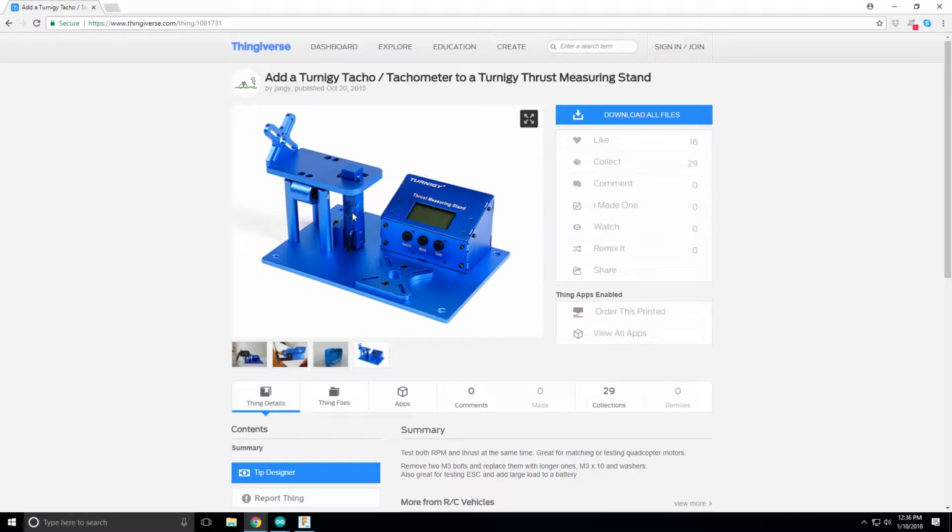And what it has is very deep cuts inside to make this side and this side of the beam very thin. That way, when you apply very little force, you'll have flex in this aluminum beam. It's made out of aluminum. And then on this side and on the back side, they have strain gauges which measure the bend of the material as a change in resistance. By doing testing to find out what resistance equals what deflection, they could figure out the force. And they have this machined very precisely, so using something like Fusion and applying a force here, they'll be able to figure out the displacement.